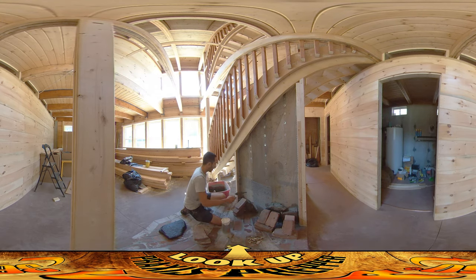Now if I was going to do the whole wall all at once I could just put this concrete everywhere, but I can only do one course at a time, so I'm going to limit how much I spread on the wall to just the stone I'm putting in. When I do these other areas, I want to make sure I have fresh concrete tomorrow for the stones going in those spots. Pulling this through and just trying to get it to grab the lath in as many places as possible, because this is what is going to hold your stones up on the wall.